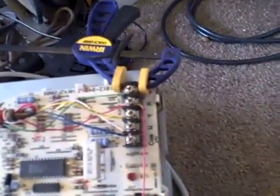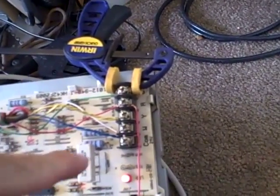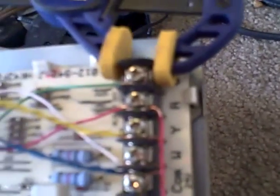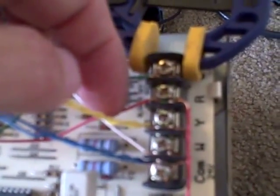Same thing — you have your tester wired up, you have your jumper up here, jumping from your power to your Y, your cool wiring, to see if you have a short. Or in this case, you're testing the reversing valve to see if that's where the short's at.